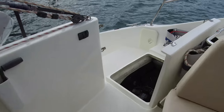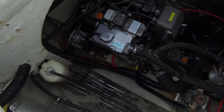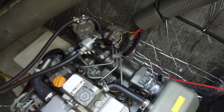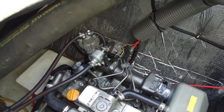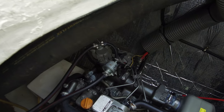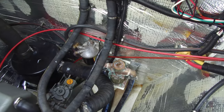Walking over to our port engine space, just taking a look in here — another nice looking engine room. We can see our alternators: one over here and the secondary one over there. On this side that's an APS 160-amp alternator, 28 volts again, military spec — a medium grade, not quite as heavy duty as the other one. It is also switchable at the helm. Nice looking engine room, really well cared for and clean, which is always a great sign.